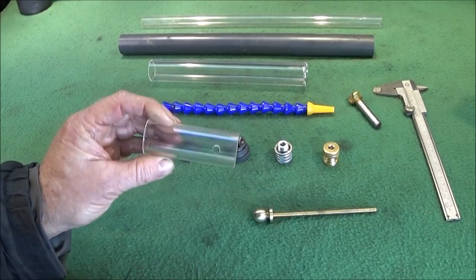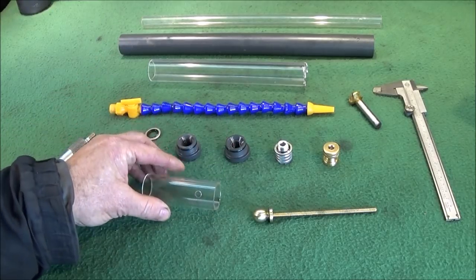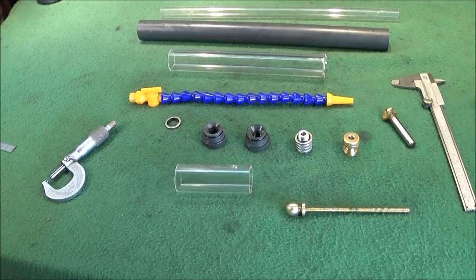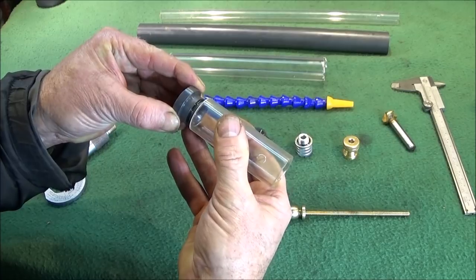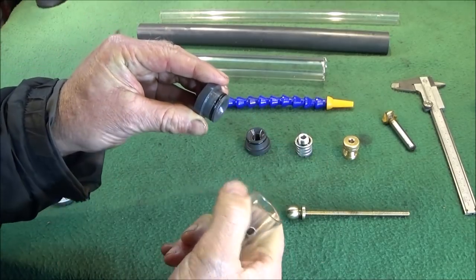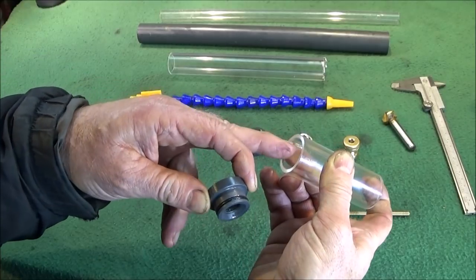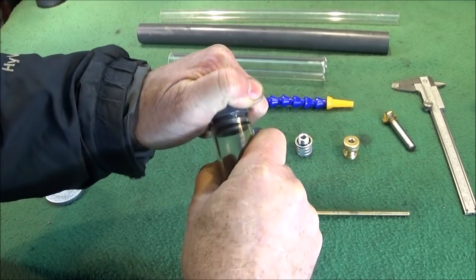In my next video I'll show you work holding tricks for things like this where they won't go inside the chuck — how you can hold it without it flying out of the jaws. I also bought some 30mm diameter dense PVC, which you can get cheaply on eBay, and machined it up to make two ends for the polycarbonate so they fit in a nice reasonably tight fit. I got some cheap O-rings on eBay and machined the O-ring groove until it's a nice fit — make sure you have a chamfer on the polycarbonate and get the squeeze right so it doesn't shear the O-ring.